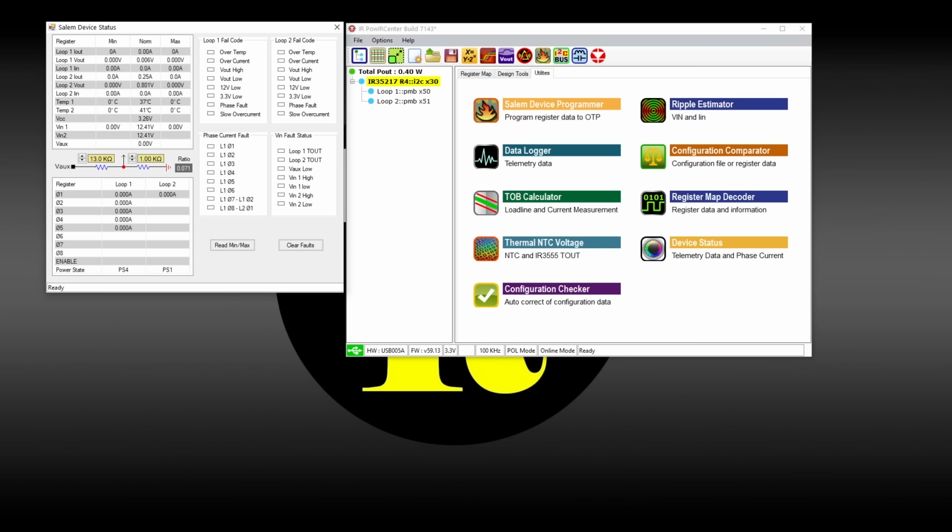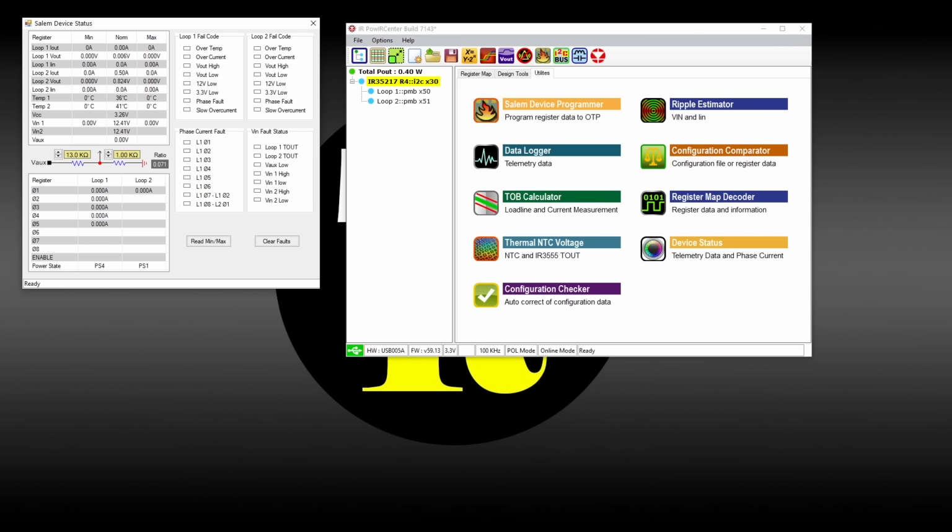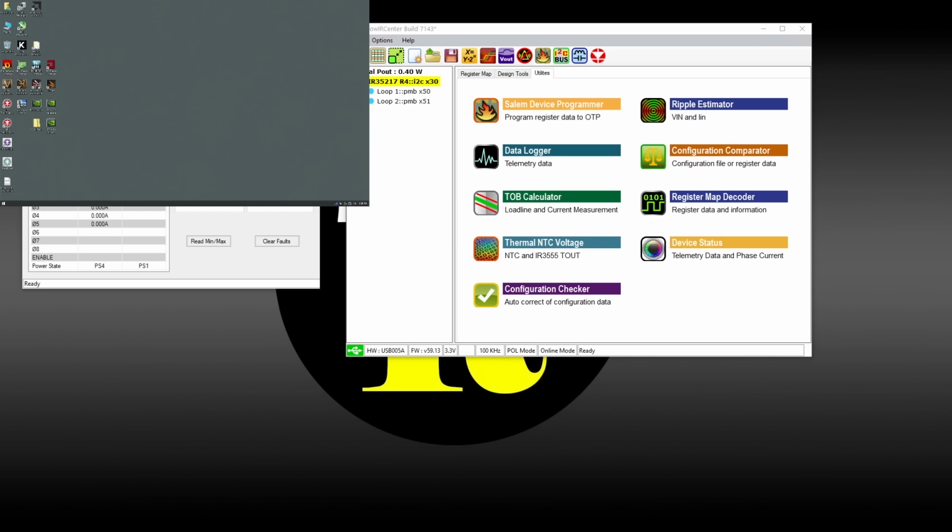The reason why I had problem flashing it is because, again, it seems to be important that you're flashing this card not externally, and that you do have a shared ground. At the very least, you have to have a shared ground with your device that you're flashing it with. So let's go ahead. I will quickly check and see if I have all the phases. I don't have any of the phases.